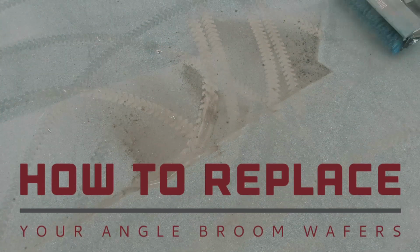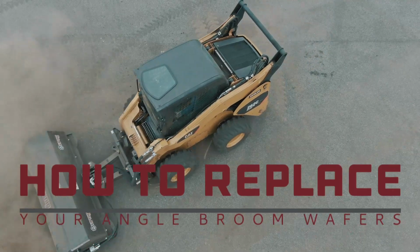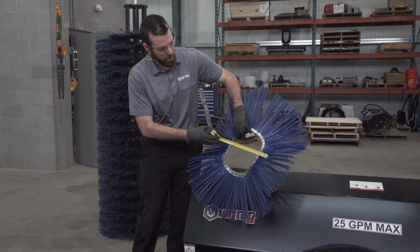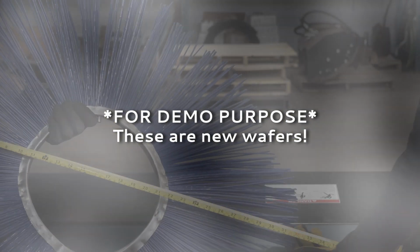If your Virnig angle broom isn't sweeping as effectively as it should, the wafers may need to be replaced. You can verify this by measuring the bristles. We recommend replacing wafers when the bristles are 3 inches long or you're not getting the clean sweep you desire.